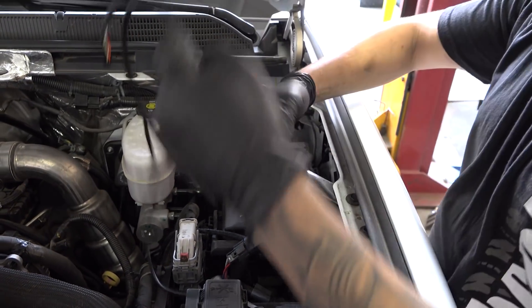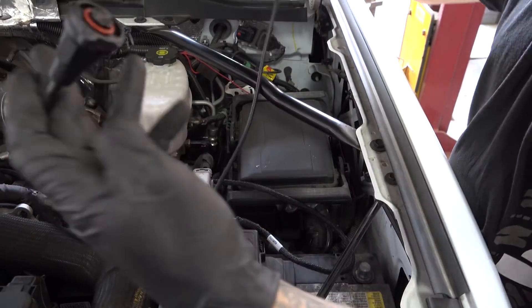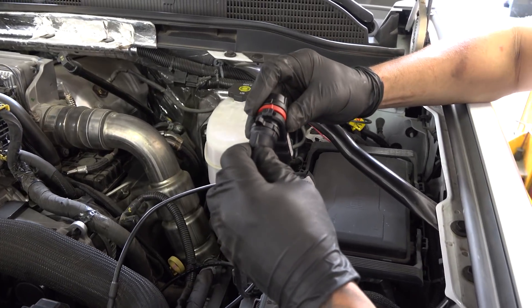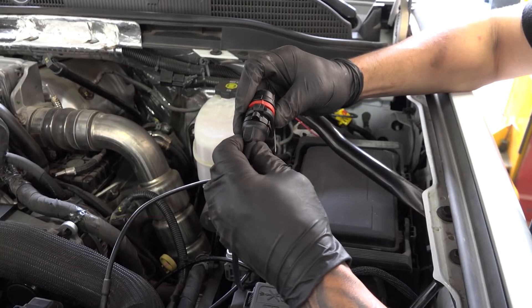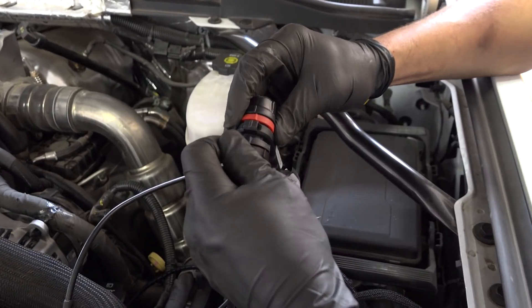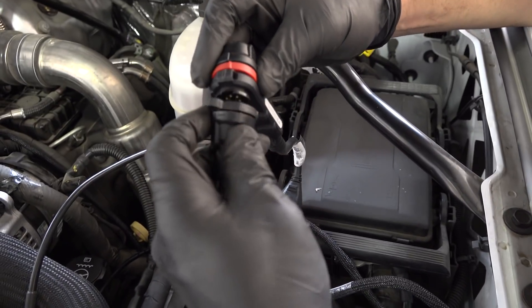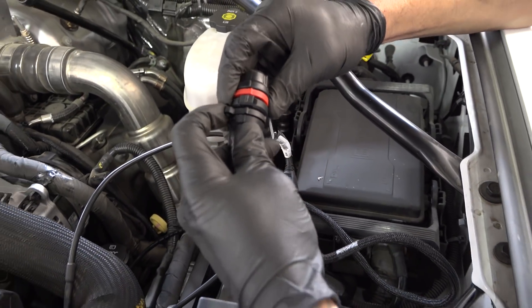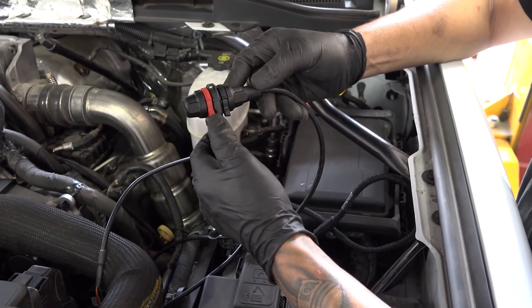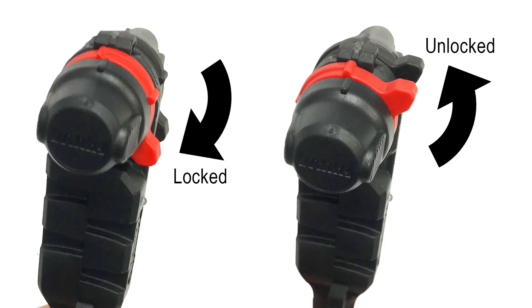Now let's attach the starter cable to the other side of the Derringer. Be sure not to just jam the cable in — these are gold-plated pins and we don't want you to bend them. Notice there's a small locating tab on the inside of the Derringer, and the same for the termination cap and the starter cable. They'll only fit together one way, and once you find it, it'll slide nicely together and you can turn the locking mechanism to latch them.